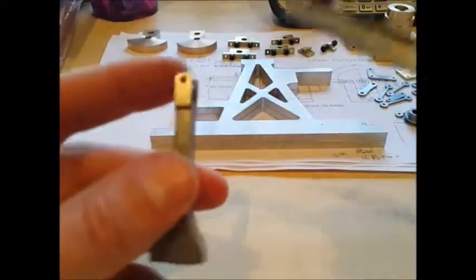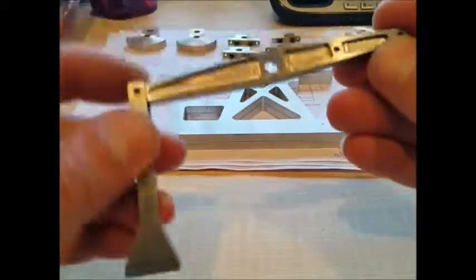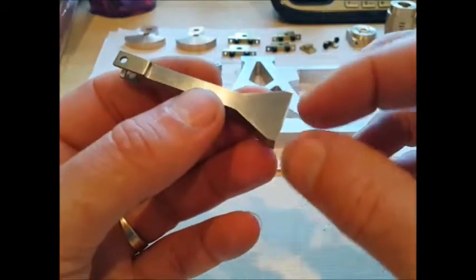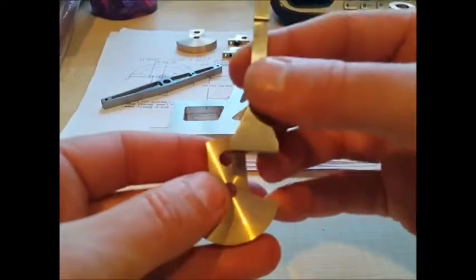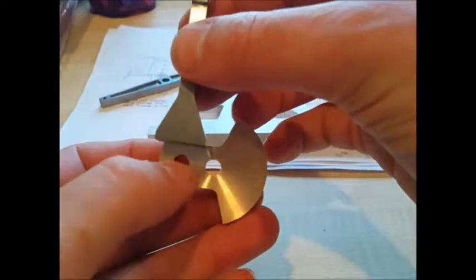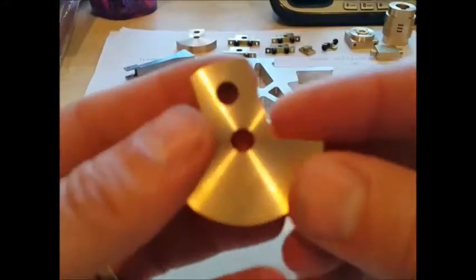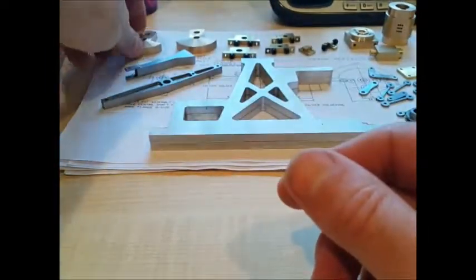This is the linkage which links the beam to the crankshaft, so obviously this will do this business. I've just got to make the bronze bushing — or in my case it's just going to be brass. There's a brass bushing which will obviously link to the crank. The main shaft is through the middle here and then the actual crank is here, so that will spin round and obviously make the piston go up and down, which is linked through to the beam. Again these are pretty much done — they've just got to have a final polish and clean up.